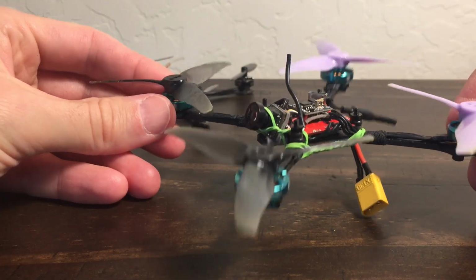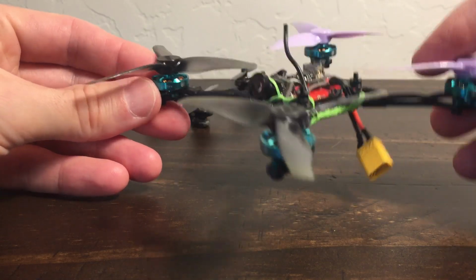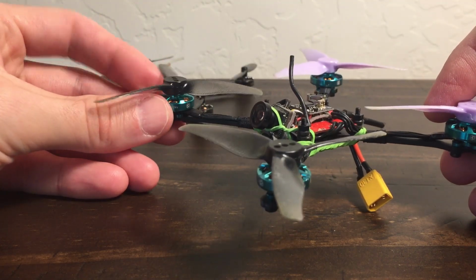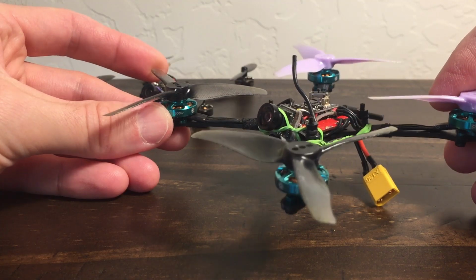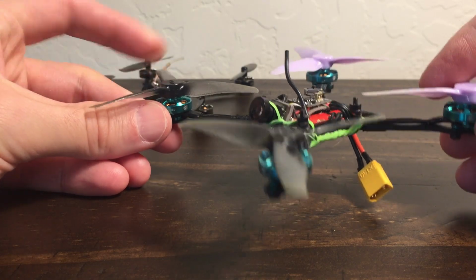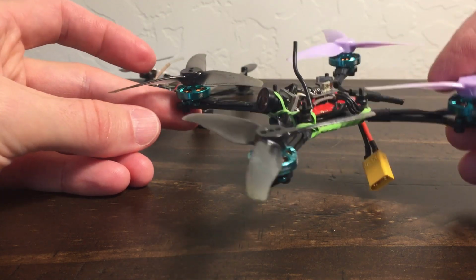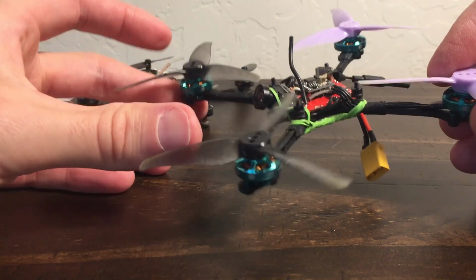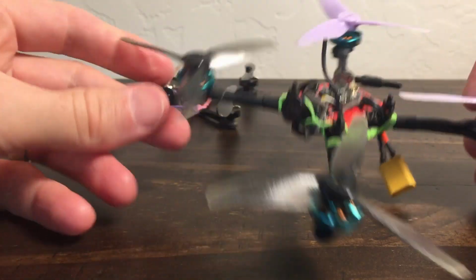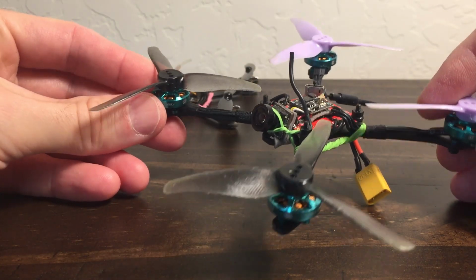I like flying this one better on 24 kilohertz, but I do see probably a 30, 40 second increase in flight time on this with the JESC 48 kilohertz. On the 450 milliamp batteries, this becomes more viable with 48 kilohertz. On the other hand, if you've got the 600 milliamp batteries, the flight time difference feels a little more negligible because it's a longer flight time overall. And on the heavier battery, to me, this starts to get really mushy. Yes, this carries weight better than the other, but weight still matters. This is still 1S. You still have to mind the weight, especially when you're sticking it way down below the prop line.